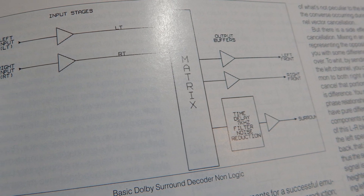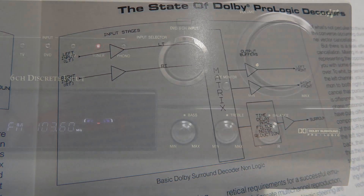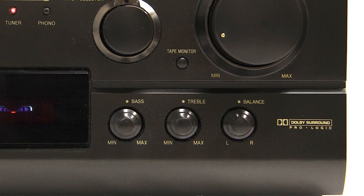The decoders didn't really hit the market until the early 80s, and those early Dolby surround decoders became outdated as Dolby rolled out ProLogic gear in 1987 — the next level of surround decoding. It's amazing: you just have a left and right channel and all the other information is cleverly encoded into that. When you get a ProLogic decoder, it senses anything that's equal in both channels, takes that, and sends it to a center channel, dropping it a few dB to be equal amongst all channels.